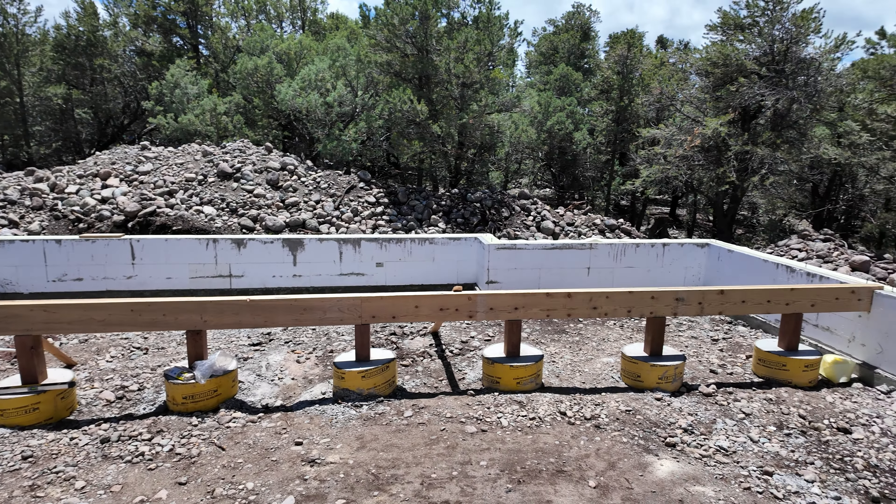Once we start building the house, the weight will hold everything down and there's really no need for any kind of supports bolting it to the concrete. This is fine just being right on the concrete. The beam is held: it won't fall forward or backward, it can't go side to side. Usually when I do these floor videos I always get the question of what I'm using to bolt these down — and it's nothing, it's just friction and gravity, and that works perfectly.